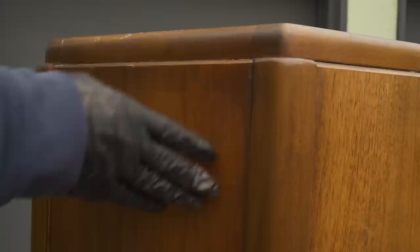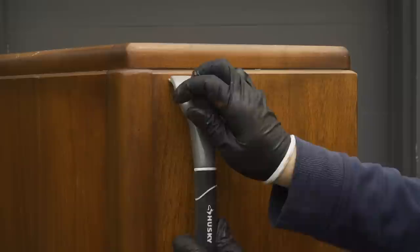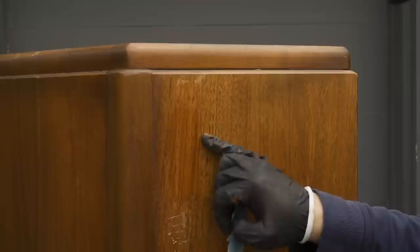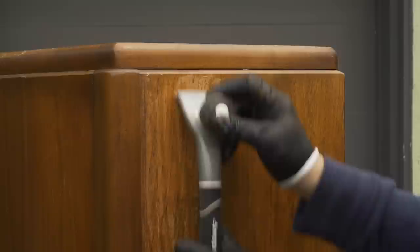Comparing both sides, this side is also a lot darker, so I'm thinking this area is probably bleached out. Sometimes the bleaching is only in the finish and doesn't go down to the wood, so I'm curious to see when I get this finish off if the wood underneath is darker. Now I'm going to wet this down and see — this is the bare wood and this is the wood with the finish still on it. So it looks like the bleaching is probably mostly in the finish.